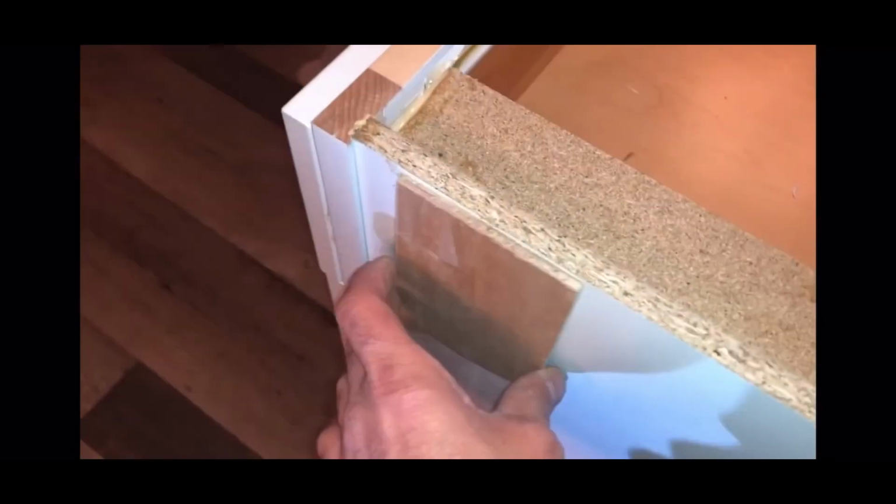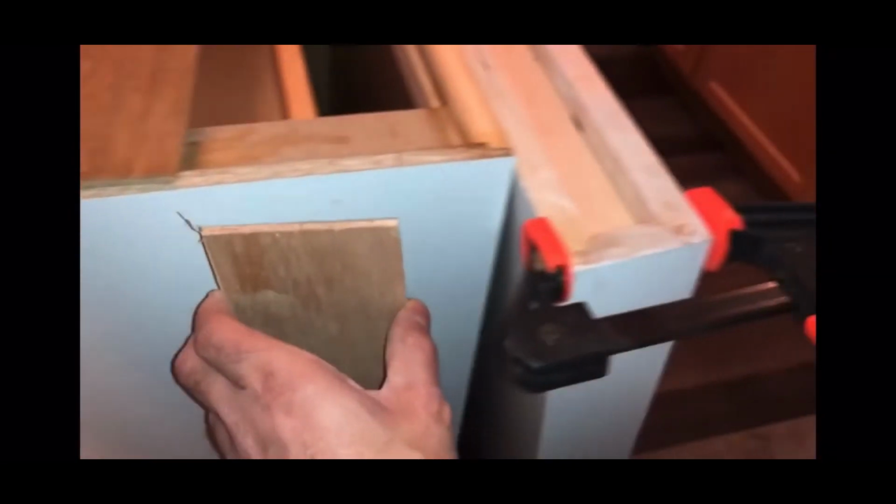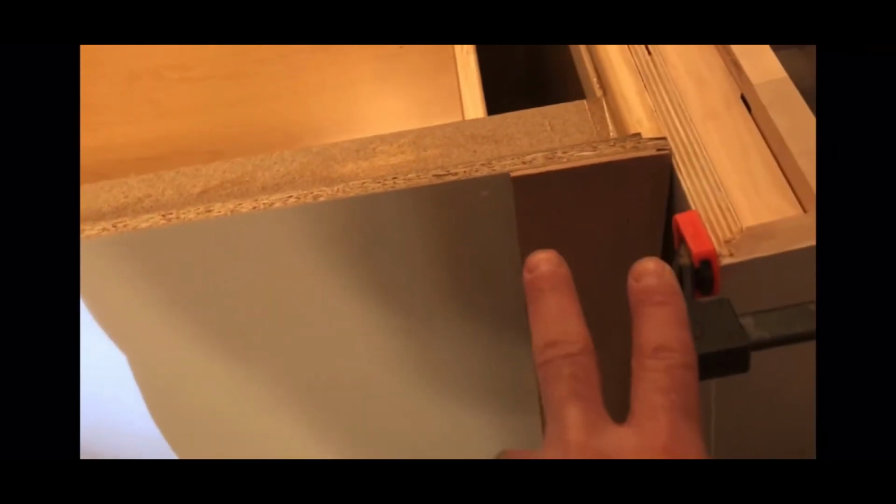Also, I purchased a piece of trim that's gonna go along the bottom just to make it look nice. This is a Luan, about 3 inches wide. You can see that's gonna make it flush when I put that sidewall in here. So I'm gonna place this on the back and we're gonna nail gun it into there. Placed and mounted. 4 shots with nail guns, 2 there and 2 there.